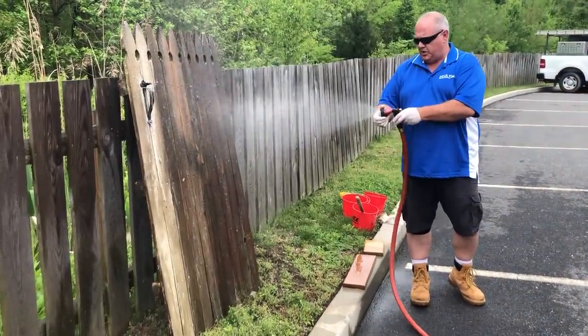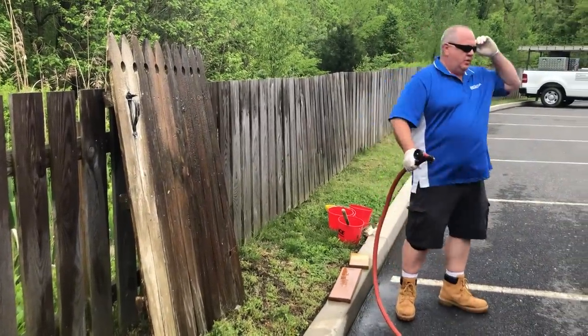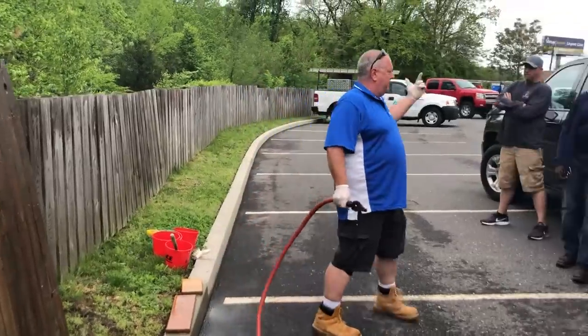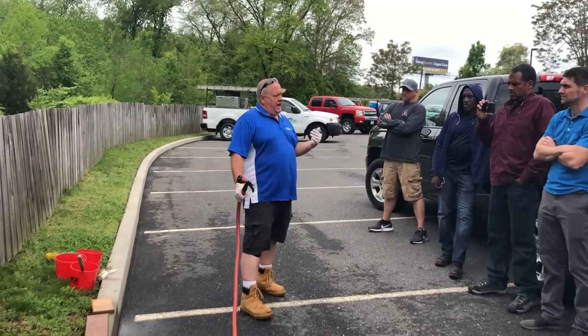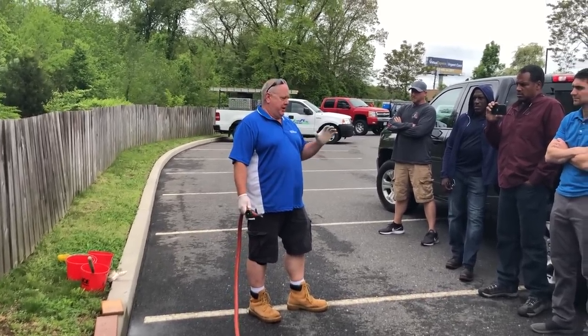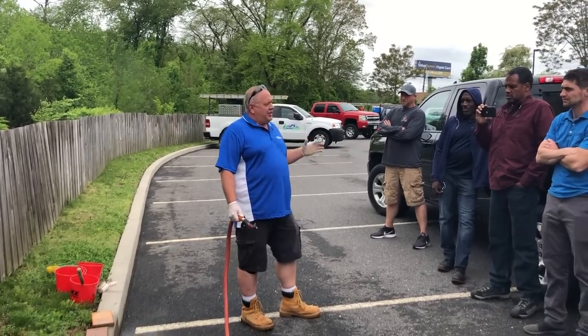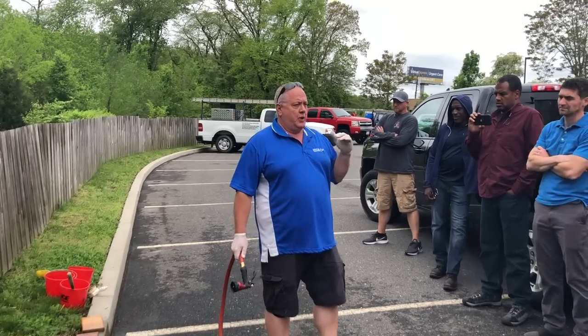Now, one of the things I talked about inside, I mentioned when Lonnie was talking, everybody thinks oil bases are all penetrating. They're not. That's why when people say, hey, I had a bear of a time getting it off, it's a bear to get off. You run into that because they use linseed oil. And linseed oil is quick drying.